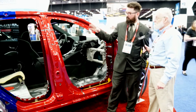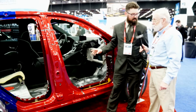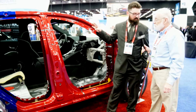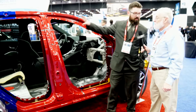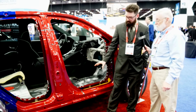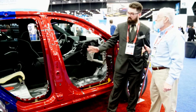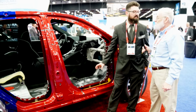We're able to do that by tailor welding it. If you look at these lines here, this is all laser weld seams that allow us to put the right thickness at the right location. We're able to apply thicker parts where we need it — up top — and a more balanced thickness at the bottom.